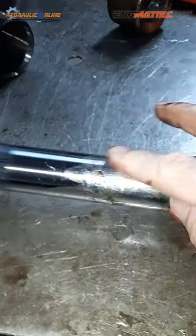Now I'm going to pull this out. You won't need this next step in the vise. So the next part is the wear band. Nice and lubricated. I might have to actually squeeze it. These are really hard to put in when you're lubricating them because they're so slippery. Sometimes you have to squeeze it, make it smaller than the groove that it's going to go in. I would have kept that in the vise personally.